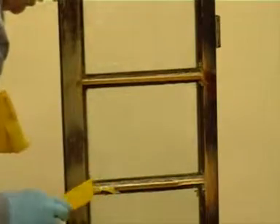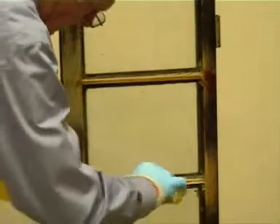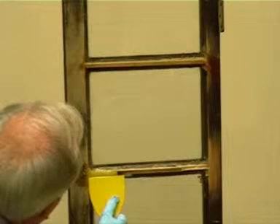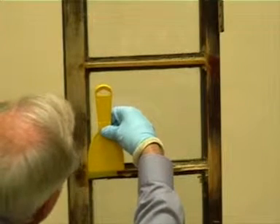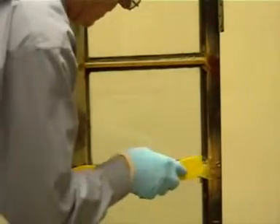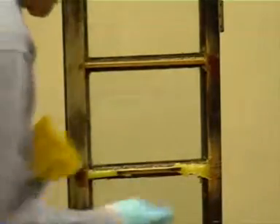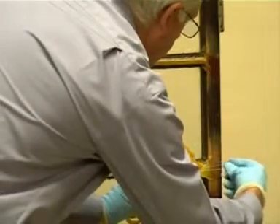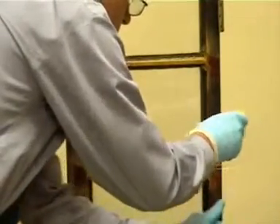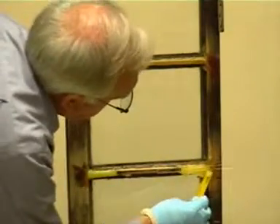The second repair is a pure resin repair. The third repair is using Perspex to form the glazing bar. Using Perspex helps to achieve long straight edges where freehand would be difficult. These repairs were undertaken using DryFix and DryFlex 4.